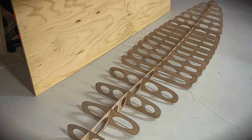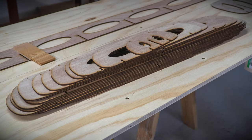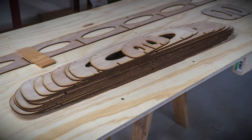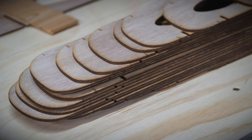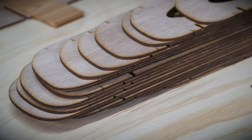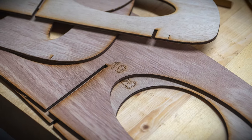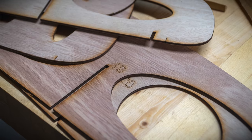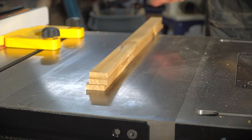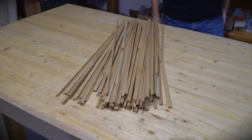The strips that make up the outer skin of the paddleboard are glued directly to the internal frame. The problem with this is that these thin ribs don't provide much gluing area for a strong bond. So it's common practice in surfboard building to add some blocking or strips to the edges of each frame to increase the surface area for the glue to adhere to. In my usual fashion of making things more difficult than they need to be, I decided to use triangle strips instead of squares to reduce weight, and because there was an off-cut of cedar in my shop just big enough to work if everything was cut into triangles. With the plan in place, I cut the board into strips, then into squares, then into triangles, giving a useful pile of triangle reinforcement strips.